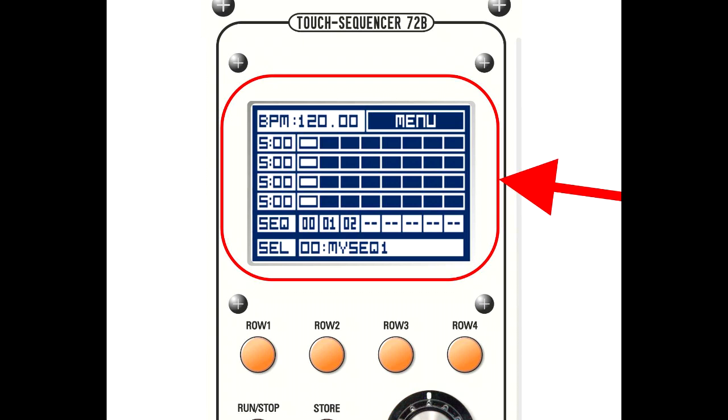Manipulating the touchscreen can be done using either a typical PDA stylus or a well-shaped fingernail on the screen. The screen surface is extremely durable and should provide years of scratch-free service. The 128 by 64 graphic LCD itself is based on reliable technology that has been around for many years.